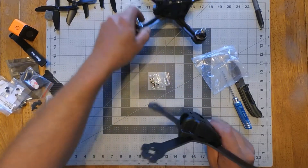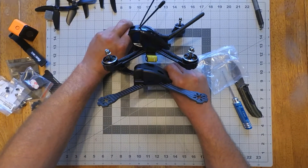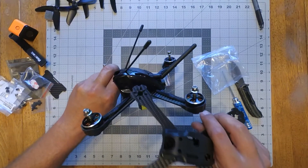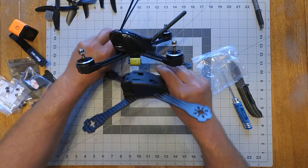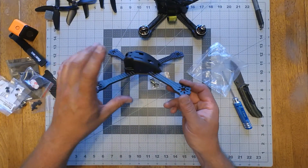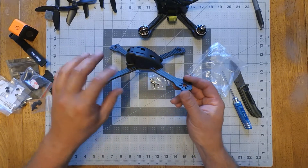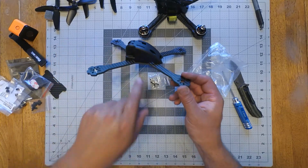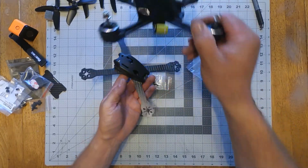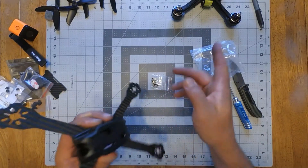All in all, I think it looks pretty sweet. It's lower, so it's going to be really hard to get everything in — this build was really hard to get everything in and it is taller. This is definitely not a beginner build. You're going to want to do something like the Flame board, and I'll have a review of that coming up on my channel real soon. You're going to want to run your ESCs on the arm so all you have is that one board in there, otherwise you're never going to fit your receiver and your VTX. I got an X4SB in there — just check out the build video on that one.